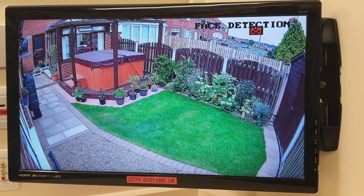Now, as you know with CCTV Systems UK we call it how we see it, and there are two downfalls to this DVR. Number one: you can only have face detection on one camera. This is a 16-way DVR — it doesn't matter whether it's an eight or four way, you can only have face detection on one camera. I would have preferred it on four, but it clearly uses a lot of the chip's processing power, which is maybe why it's limited to just one camera.